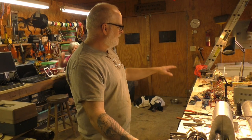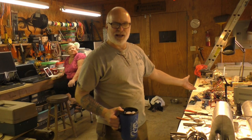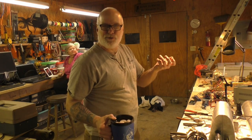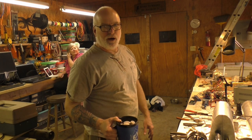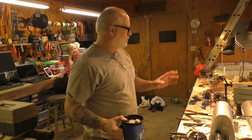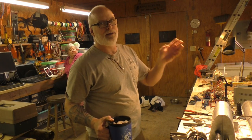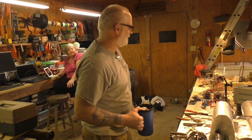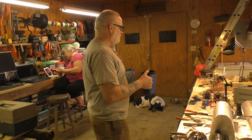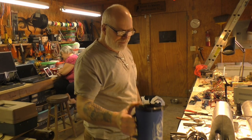I didn't finish on heat: the drivers don't get that hot. The LEDs get super hot but they're out in the water. We don't run the LED lights unless the ROV is sitting in the water because it just doesn't have a heat sink otherwise. Charles Scott says the way he's seen those relay boards hooked up, the 5-volt supply controls the relays and a separate 12 volts is controlled by the relays.